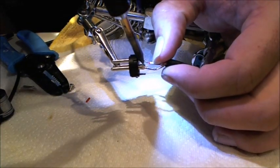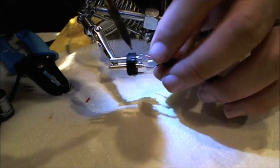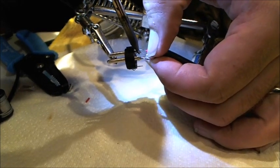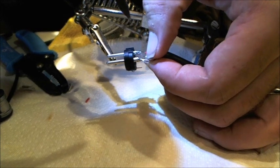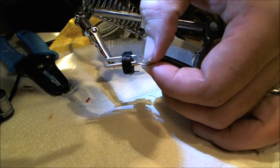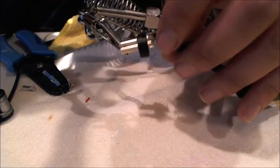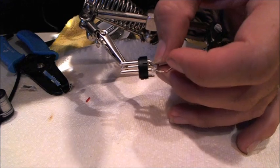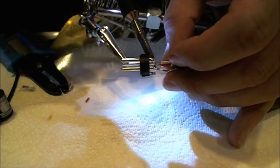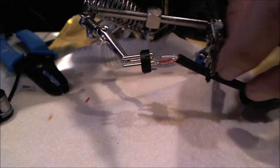This is actually lug number 3. You see, the solder got a little cloudy there. It's kind of moving around in there. I'm going to redo it. That looks a lot better. And don't touch the other ends of those. Don't touch these ends either after you did it, because they're really hot. Don't ask me how I know that. All right. I redid that one too, because the first time I did it, it got all cloudy for whatever reason. So there it is.